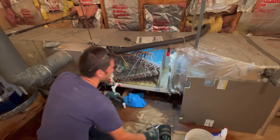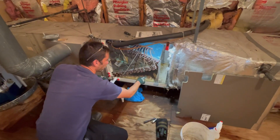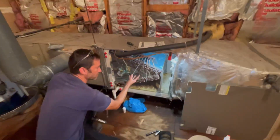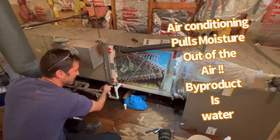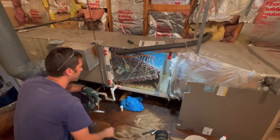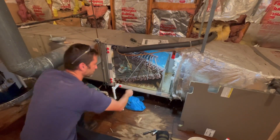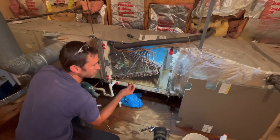Since I can't get to the other side of this, I'm going to pull out my swoosher gun and flush that down. But first, let me pop this door off just to take a look in here. So I'm inside of the evaporator coil section — this is a drain pan. You can obviously see there's water all through the bottom right now. What happens is the minerals, after an air conditioner cools down the air, it's dehumidifying — it's pulling the moisture out of the air. It goes down to the drain pan, then it wants to go down the drain and down to the main drain in the facility.